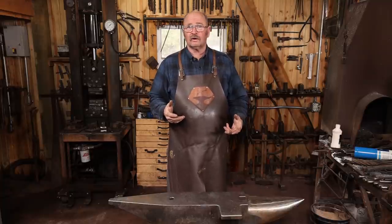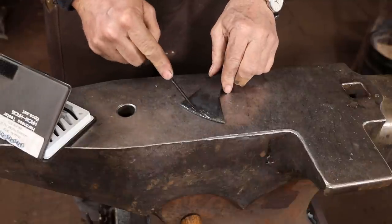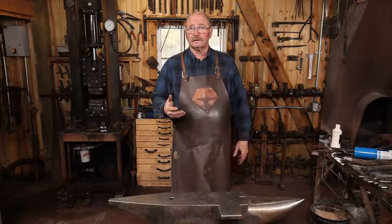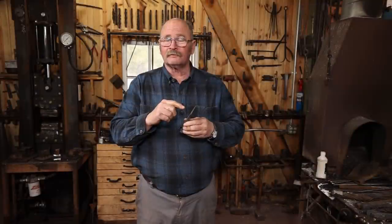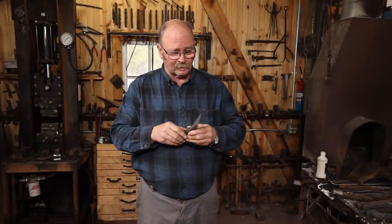A quick test as hardened with the Rockwell testing files shows this is between 55 and 60 Rockwell. That's a pretty good hardness for an axe. I'm gonna go ahead and temper it for an hour in the toaster oven at 450 and see what we get then. Well, after tempering and on closer examination, I see another fatal flaw in this little axe,